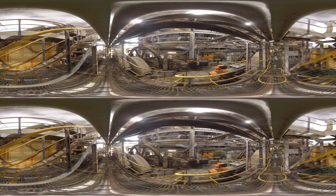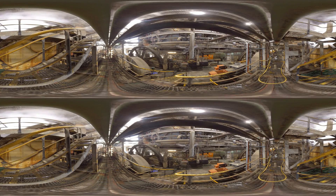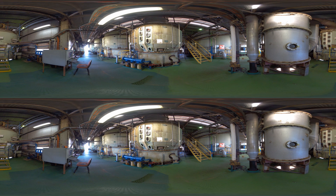The fibre left after the juice is extracted is called bagasse. This bagasse is used to fuel a boiler which generates power to run the entire milling operation, making the mill self-sufficient for its energy needs. The cane juice then goes through a series of heating, clarifying, evaporating and crystallising stages.